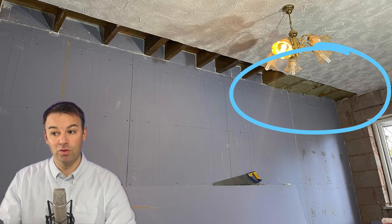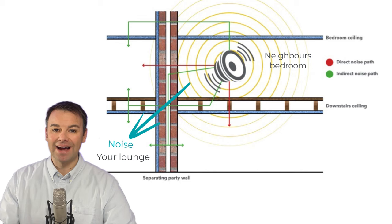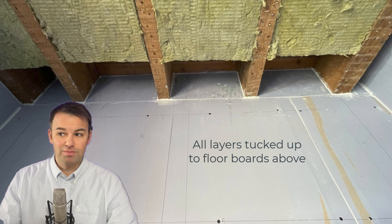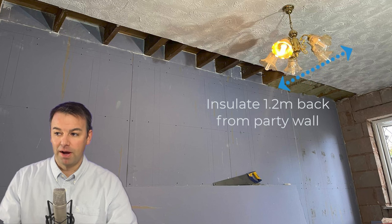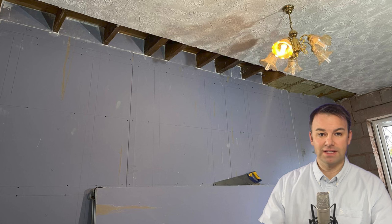You can see we're just starting to insulate back above the ceiling. After tucking the system up with all the layers around the joists, you can see that tucking it up is about 80% of the work. We've put 200mm of rock wool in the ceiling joists insulating back 1.2 metres from the party wall — that's because the rock wool slabs are 600 x 1200 x 100mm, so we've put 200mm in to go 1.2 metres back. On this final layer of 15mm soundboard we haven't sealed the screw heads because the sealant can get caught in the plaster trowel.